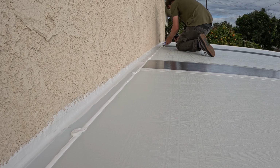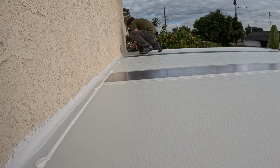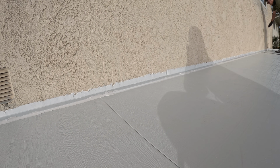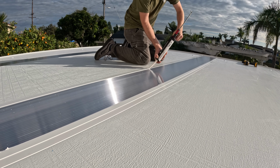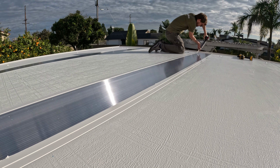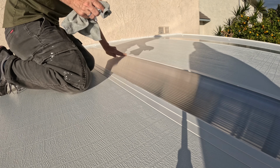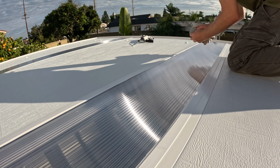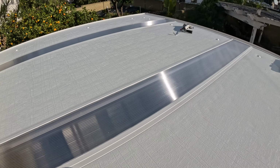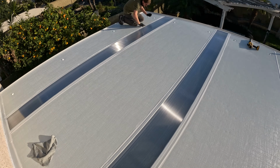And here we're sealing the roof. So we use Tremco on this roof. That's generally what C-thru's been providing us with. So that's pretty good for sealing the seams. On the skylights, I've been using Dowsil. So not even cutting the tip of it, just sealing that little bead. Technically there's a gasket there, so you don't have to seal it. I've just noticed as far as callbacks, you eliminate 90% of them just caulking that seam.